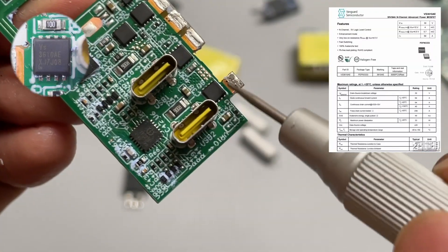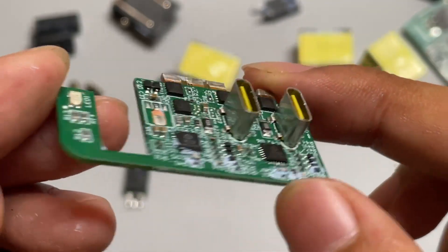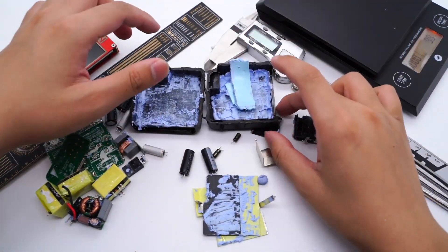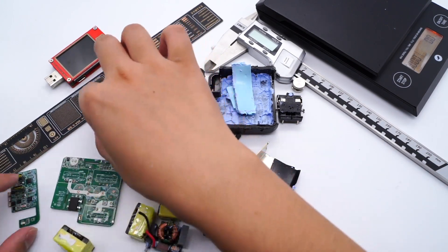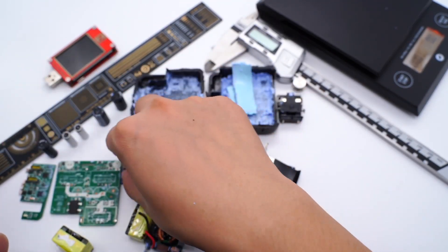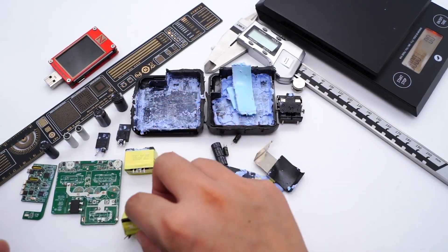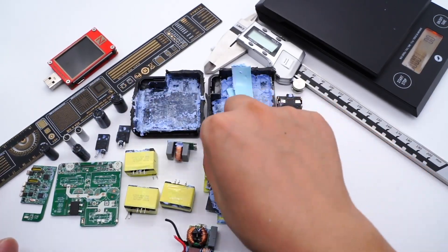The output VBUS MOSFET of the two USB-C ports is the same model. That's all the components of this charger. Because of GAN components, the size is very small. It also adopts a brand-new structure that supports 100W without a secondary step-down circuit, so its efficiency and temperature performance are also better. By the way, the Power Integrations master control chip is the same as the one used in the Apple 20W charger.